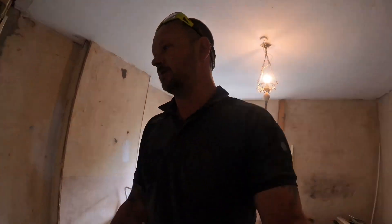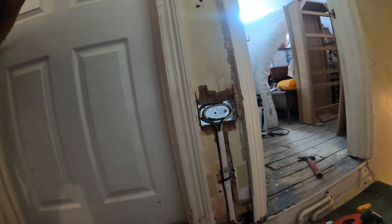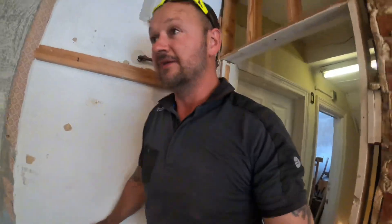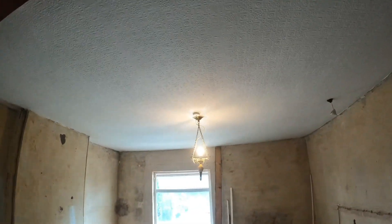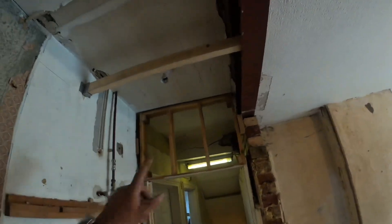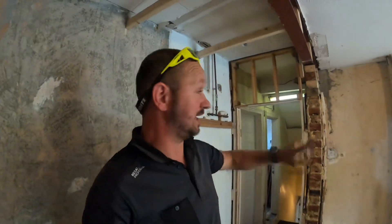I even got this one in the hallway in this stupid little bit, but I put that in a 25mm box because the chaser wouldn't go deeper — so that's definitely getting a 25mm box. Now all we need to do is get rid of that two-way switch over the bed, the centre light, and the switch. Basically one more chase down for the light switch and then get out of here.